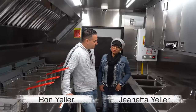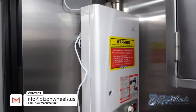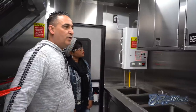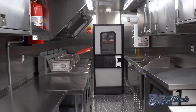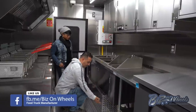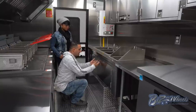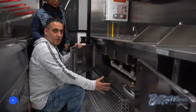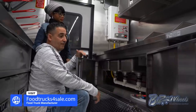Explain to me a little bit more about this kitchen. You have a cabinet right there with a drop-in three-compartment sink and a hand-washing sink. This is an on-demand propane water heater — as soon as you turn the hot water on it will kick in immediately and you're going to have water at 120 degrees instantly. The generator on the outside is actually located on the bottom inside the cab, and above it there's a cabinet we use for space. The cabinets can be used for plumbing and storage for chemicals, and you have the valve to open and control the propane for the water heater.